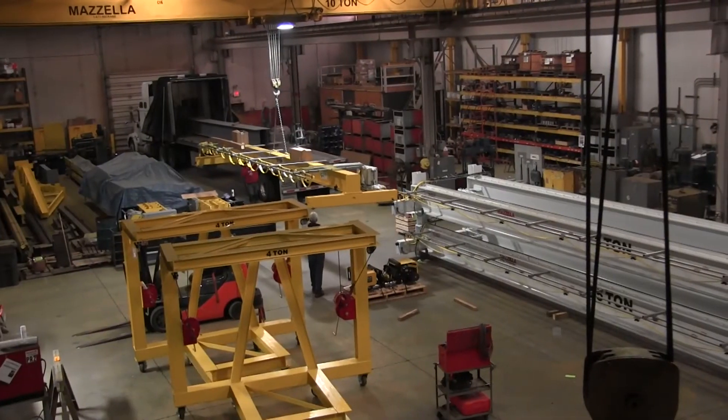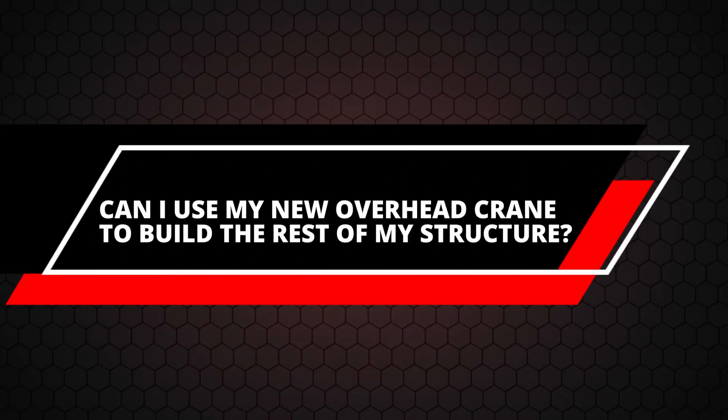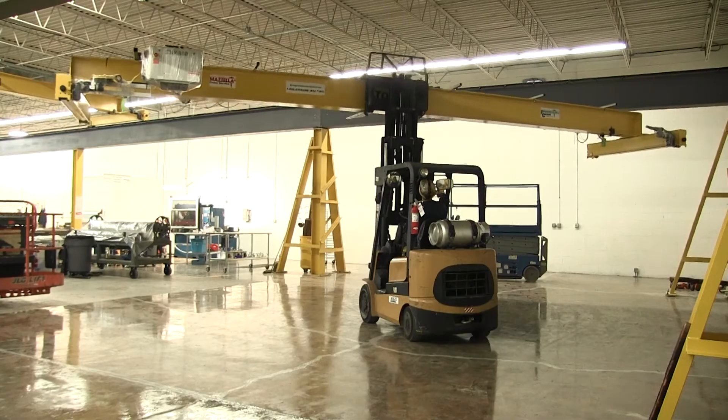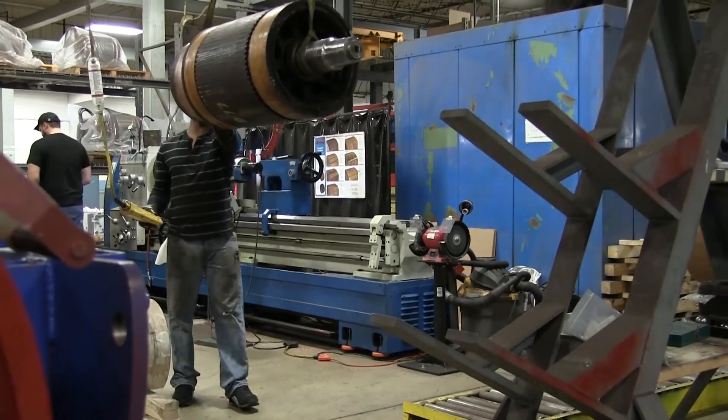As Chris and I got talking, he told me that for some places it's awesome to get your overhead crane built first, so that everything else that comes to your building can utilize and benefit from it as you construct the rest. A lot of times people put the crane up first in order to use it to put up any other components. It's a benefit because you don't have a mobile crane on site or any other rental equipment to pay for — you already have the crane, it's load tested, and it can be used to put everything else in as the building is being built.